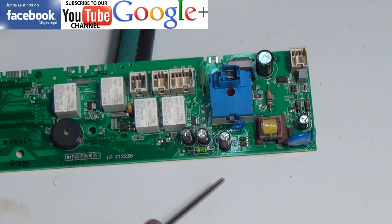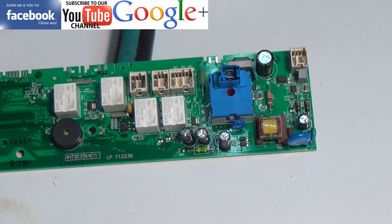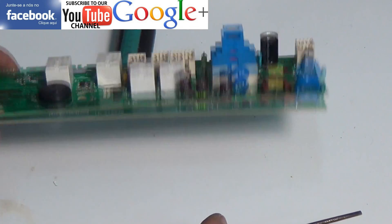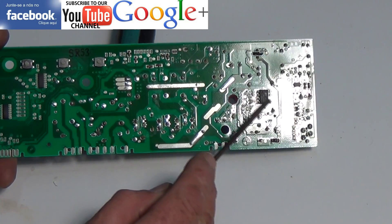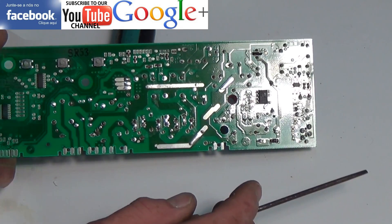On this circuit board I do know that the resistor on R76 has gone open circuit. It should be showing a resistance of 4700 ohms but we're only getting open circuit. This has been taken out by the link switch, which is a common failure on this circuit board.